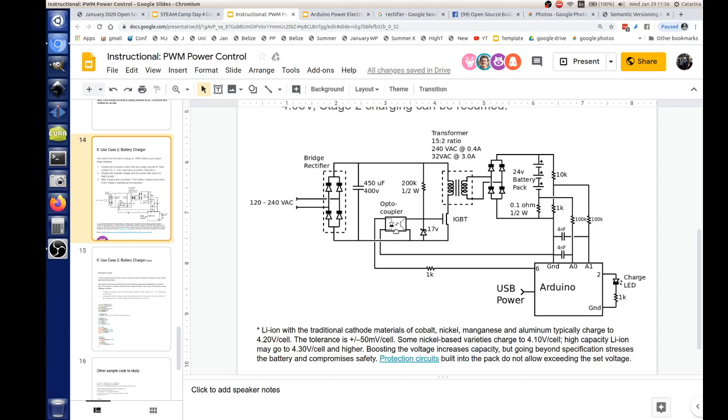This is our transistor like in the other one, but the optocoupler is really cool. It has a little LED in it, and then it has a transistor that is optically sensitive. Whenever the LED shines a light, the transistor gets that light and it turns on. And you have something ridiculous, like 1,000 volt isolation between this side and that side. The only contact between them is through photons.